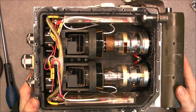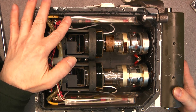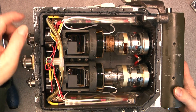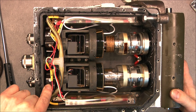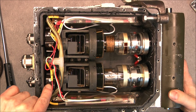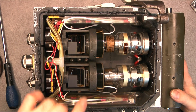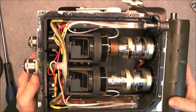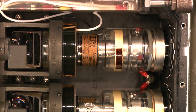Yes, it is quite different because I believe this high voltage connection is different. The boxes here are in clear plastic and not white plastic. The two devices we did not have previously are here and they seem to be some kind of potentiometers, so it is an electrical adjustment for the focus of the tubes — not mechanical, I was expecting something mechanical. Same prism assembly here I believe, and very different photo-amplifying tubes — these ones are not the same model number and are completely different.